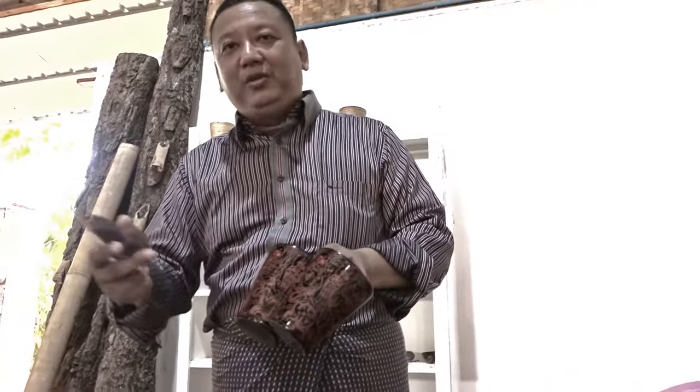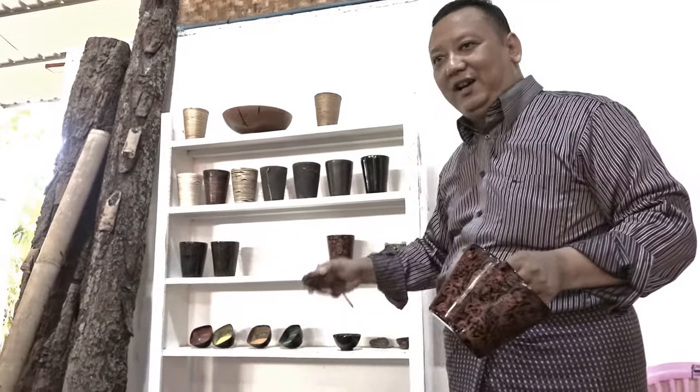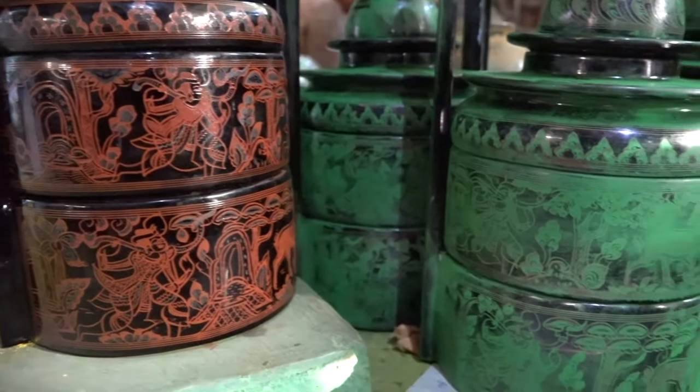After applying the green color, we need to wash it down with water to remove the acacia from the surface. Because we then have to apply the top color again in the same process — protect again for the next color, and go to the top color.